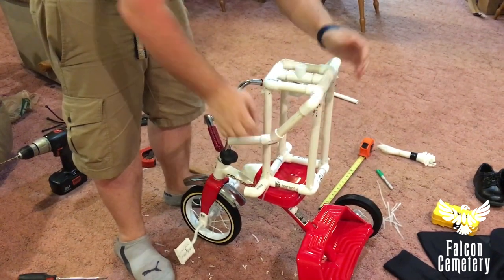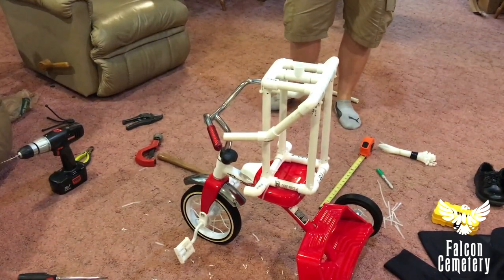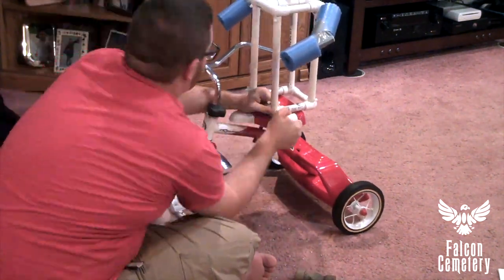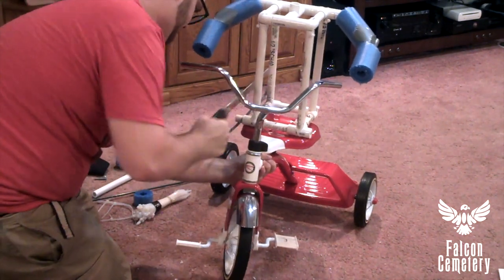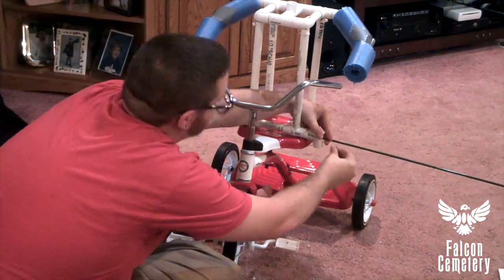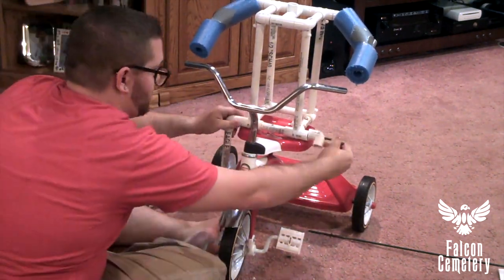So I'm just going to put in some connecting pieces for his arms. I didn't end up keeping the arms like that — they didn't really fit, especially with the jacket I had purchased. I made some different arms later. So here I'm creating the legs. I'm taking off those PVC sections because I realized I needed them to move freely, because those are basically his hip joints — so I'm sawing that off. And then what I use for a lot of projects is some green tomato stakes. I drilled holes through those elbows, and that way the little joints can rotate freely. Then I put the little end caps for the tomato stakes on both ends, and that keeps the PVC from sliding off. It actually worked really well.